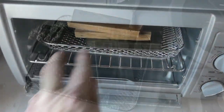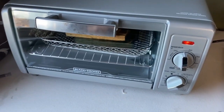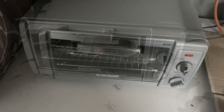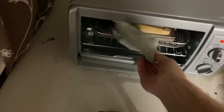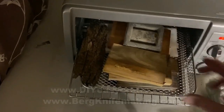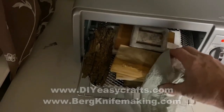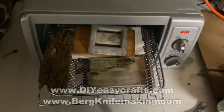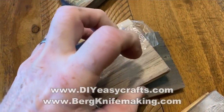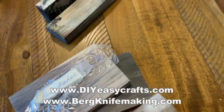The next step is to harden the stabilizing resin. You do that in an oven — you've got to get it up over 200 degrees, somewhere in the 200 to 250 degree range. In this little oven that means I have to set it closer to 250 to 275, which I verified with an external thermometer. The cook time has no set duration; it's dependent on the thickness of the wood. For thin pieces like these, at least two to two-and-a-half hours.